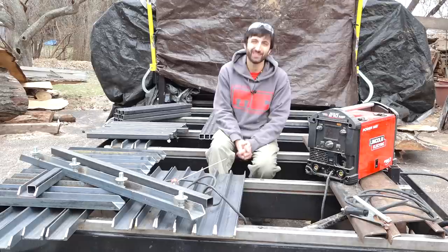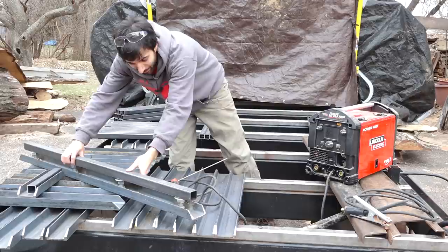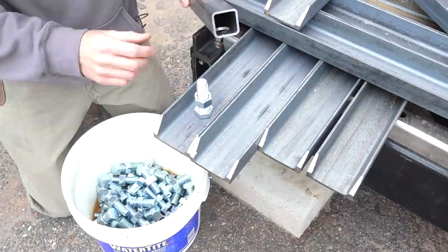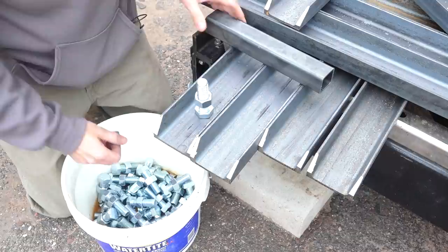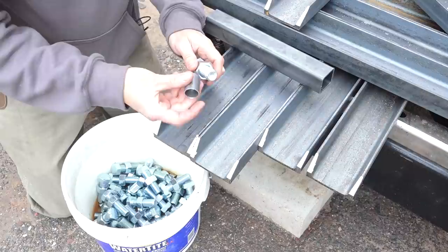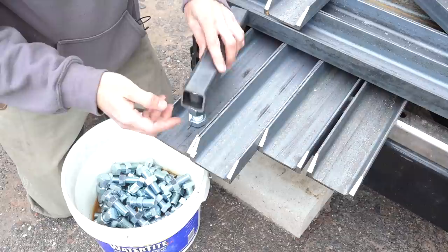If you want to see me slice up that log, I'll leave a link to that. The next thing is adding the studs, which support the top piece and allow it to be adjusted to whatever angle it needs to be at. The bolt gets welded down into the C-channel. Last time I just did this by feel, but a couple of people gave me a really good suggestion — a little sleeve. The bolts get sleeved, and the sleeve has a little bit of space so there isn't any alignment issue, which takes a bit of the guesswork out of it.